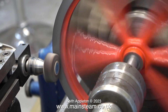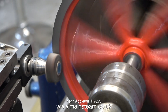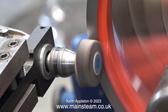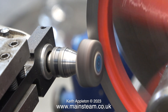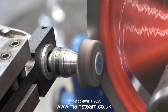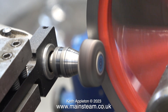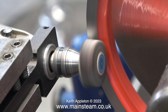Please be aware I am not putting much pressure on the flywheel with the flapper wheel. And I suppose it would be a good idea to run the lathe in reverse, but the reversing switch on this particular lathe is currently faulty — I'll put that job on my list of things to do. You can hear the nice sound that's being made. The good thing about doing this job is it doesn't give a polished finish to the edge of the flywheel — it looks like it's been turned with a scaled turning tool. Yes it's shiny, but it does have some machining marks in it. I am using a very slow traverse speed on the cross slide. Everything said previously about speeds and feeds refers to turning and is not really necessary when using a tool post grinder.